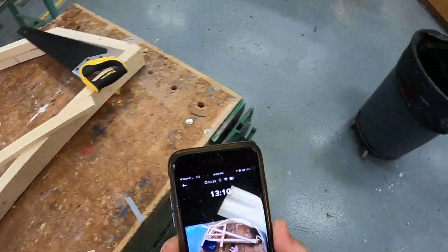Oh, these are the sides that I sanded, so they are all beautifully flat. You are going to make a decision for how tall you want your bottom shelf to be. My boots that I wear in the winter are pretty short. They only go up my foot about that far. They're like 7 inches. So I'm gonna put my bottom shelf at 10 inches off the ground.